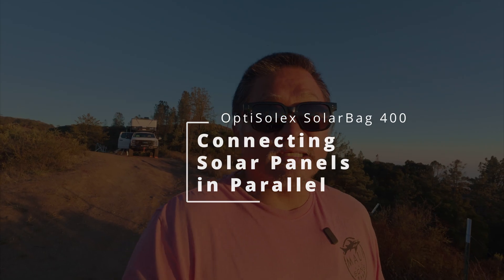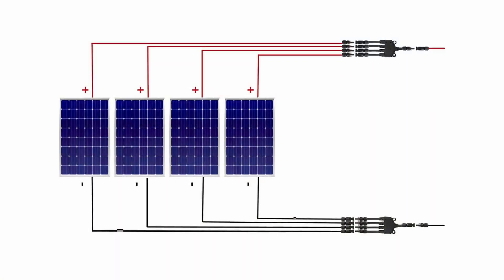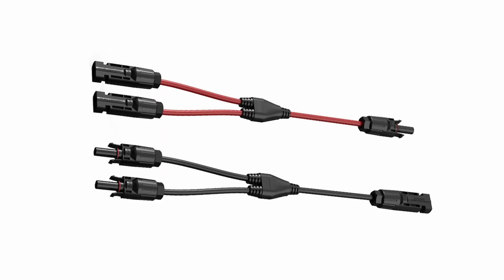The first type of solar connection with multiple panels is connecting panels in parallel. To connect panels in parallel you wire positive to positive and negative to negative. This setup keeps the voltage the same but increases the amperage. It's important to use panels with the same open circuit voltage to avoid power loss and imbalance, and you'll need MC4 parallel connectors or compatible junction connectors for secure, weather-resistant connections. For example, four 100-watt panels in parallel will still give you about 20 volts, but amperage increases to about 20 amps. At 20 amps, 10-gauge wire will be near its limit on long runs, so use appropriately sized wire. Parallel connections are better for partial shade situations since each panel operates independently.